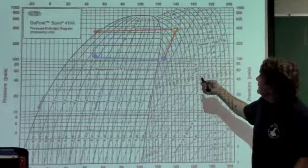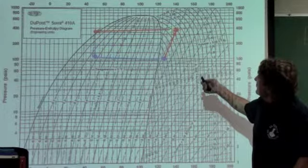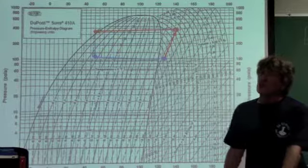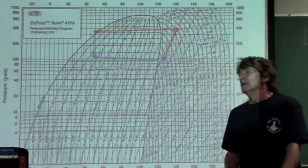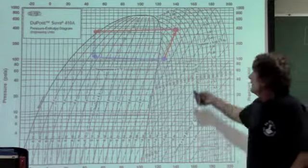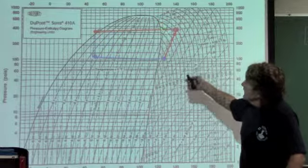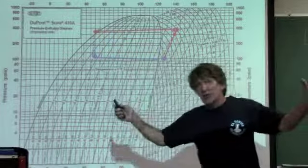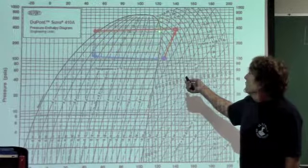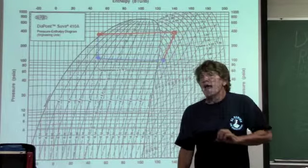I'm now going through, starting through the condenser. It's removing heat, removing heat. As soon as I leave that compressor, it's removing heat. Yes, there's some heat that gets exchanged as it's through the piping, but we're negating that right now. I'm entering the condenser, removing heat, and I'm desuperheating. Magic! Suddenly, I now turn into saturation, and those PT charts that I have will now work.